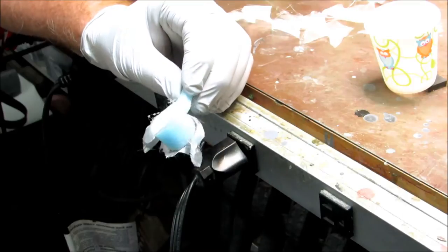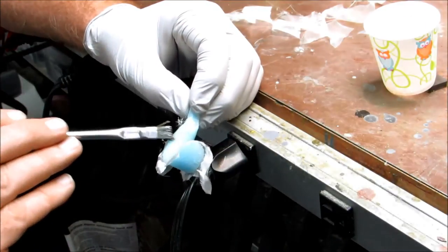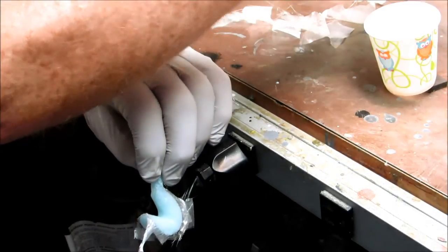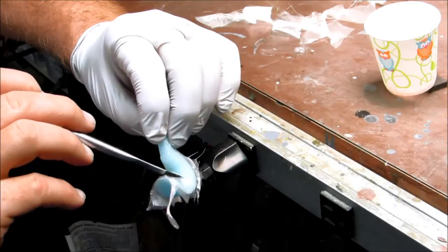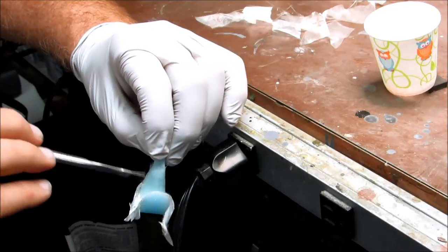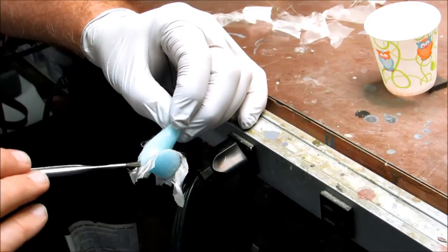So apparently a lot of what I had recorded was out of the picture, out of the screen. So what I'm doing here is I'm laying on a few layers of 3/4 ounce cloth, because it's very smooth and it conforms really well to compound curves, so I can lay it in some basically random overlapping layers and make sure that I'm getting good coverage multiple times throughout this assembly.